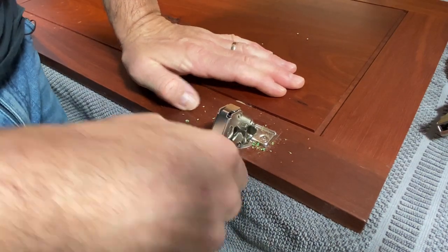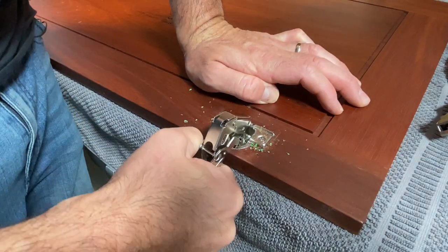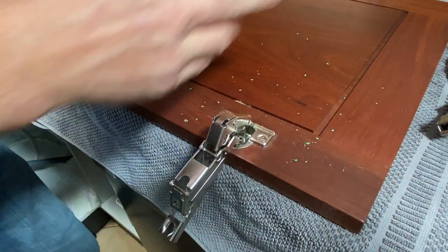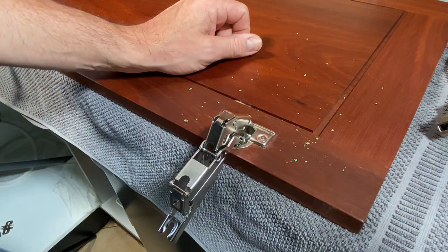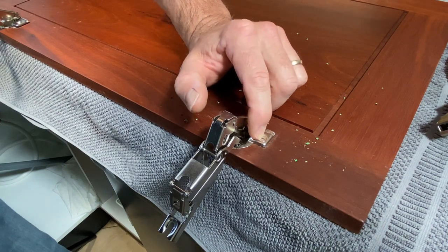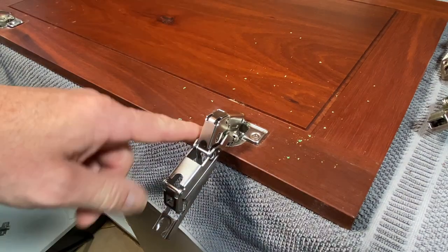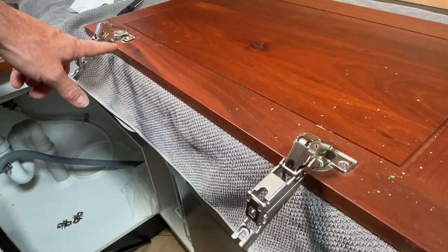Okay, this seems to be on there really strong. A wall plug to fill up most of the hole, then a pilot hole next to it — the new screws go in and that seems to be as snug as anything. Let's replicate that on this one.